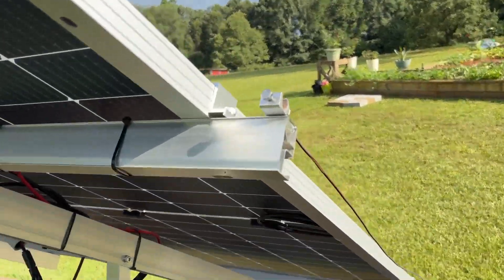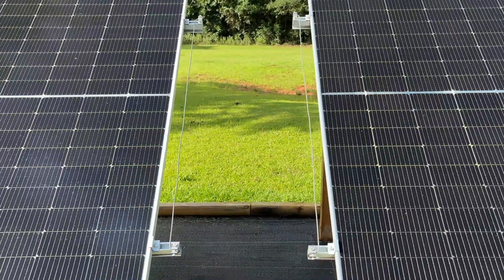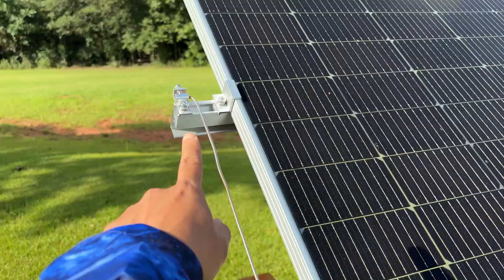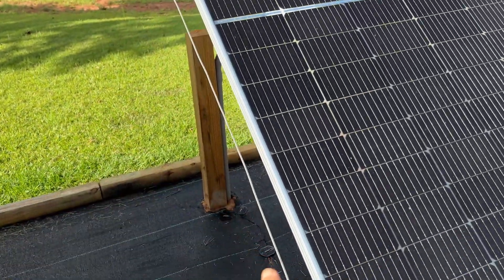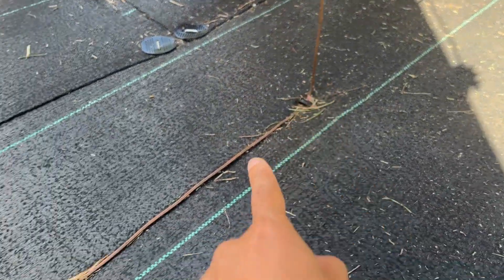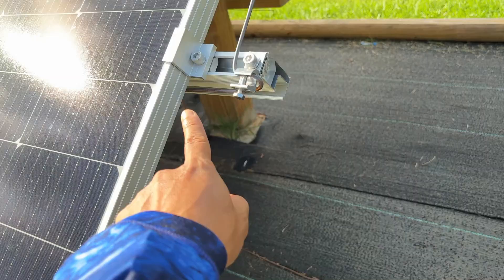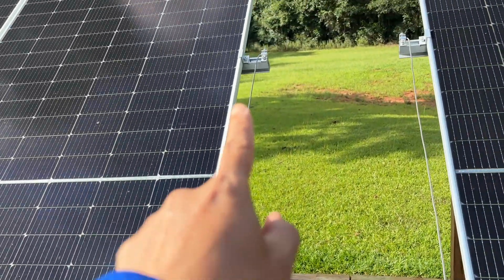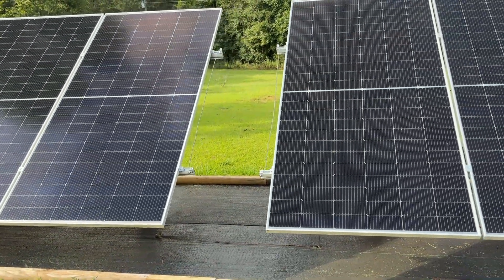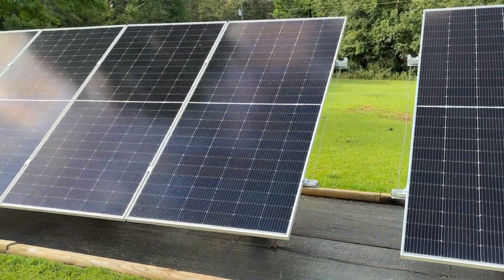Let me show you how I did the ground wires. There's also another reason I split the two systems in half — so I can go in between them in case I need to service them. The ground wire from the top rail connects to the bottom rail and flows through there to the ground rod. That same wire goes up and connects to the bottom rail and top rail of the other series of panels. So that's how I grounded it — plain and simple, clean and easy: one wire, one ground rod.